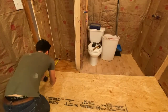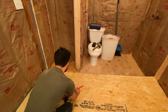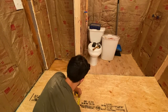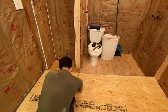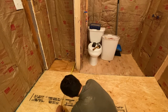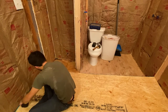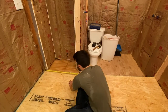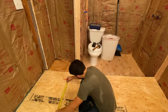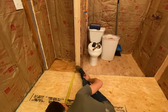Now to level and strengthen the floor, pay attention to the seams or joints of the plywood underneath. If the room is big enough to tell what direction the plywood is running, you'll want to run the sheets of subfloor in the opposite direction and overlap the seams. You don't want the seams in the same place, as that gives a weak spot in the floor and could cause issues. I also find it a lot easier to line the subfloor up in place for a complicated cut — it's really easy to put it in place, measure it out, and make sure you get it right the first time instead of having to recut.